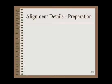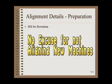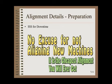Some project management issues with regard to roller alignment: first, alignment is very expensive. By expensive, the biggest cost is usually downtime — not the crew of two technicians and two mechanics that might cost more than $5,000 per day. However, this biggest cost is not a factor on new machines or extensive rebuilds because alignment can take place while other work, such as electrical work, is being done. The implication is that it is inexcusable not to align new machinery, since that is the cheapest alignment you will ever get.